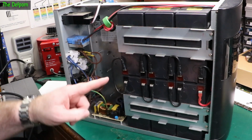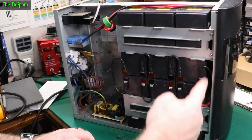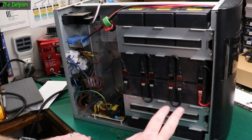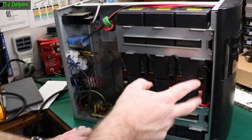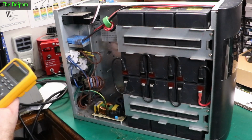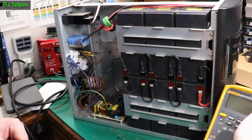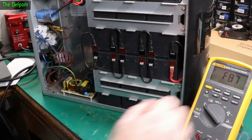We could turn the power on again whilst monitoring voltage. You've got a link here, so it's positive and negative right here at this end. Serial string. So that means that's running at 72 volts. Positive negative there. Don't stick your fingers across those, 72 volts. Let's have a look, see what we're actually getting. Then we'll turn the power on, see if the voltage seems to be climbing with power. That'll confirm whether there's any actual life in the batteries as such.